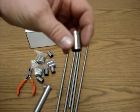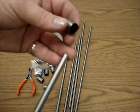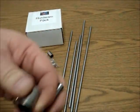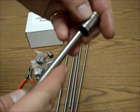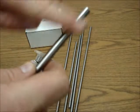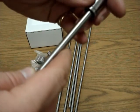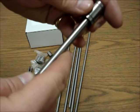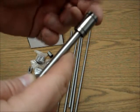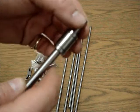When you put the bearing on, resist the urge to twist it on. These are not screws; this is not a nut. So what you're going to try and do is line it up as much as possible. It's kind of like it has a little oil seal ring on there — you don't need to put any oil on it beforehand. Just try to line it up as good as possible and barely slide it on there. If you have to, you can slightly wiggle it a little bit back and forth, but you want to slide it on there.